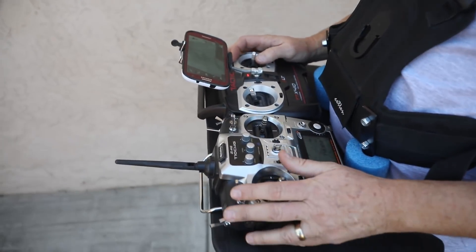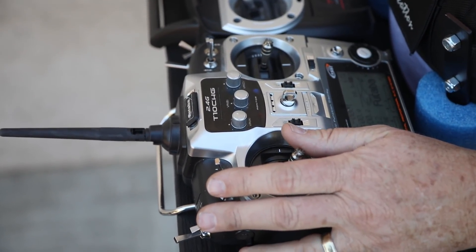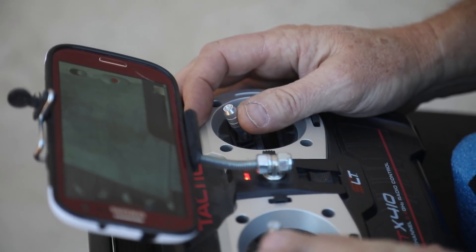I have a motor controller — a simple motor controller from ServoCity — that is running the two motors that drive the tracks. I also have two RC controllers. I run one joystick off the first controller to run the tracks, and the second joystick controls the camera pan and tilt.